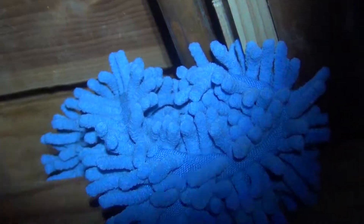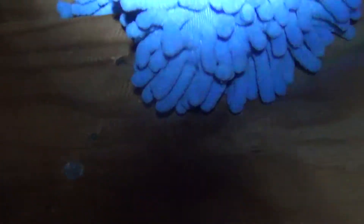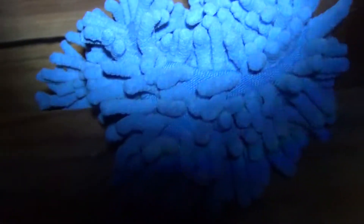I shoved my wash mitt in there hoping that would work — it did not work. I bought a water hammer arrester. There's a pressure-controlled pipe that makes the water go somewhere else under pressure; it relieves the pressure in the line and we're going to try that and see how much of the thud it gets rid of. You heard a thud — the next zone on the sprinkler system is even louder. We're going to try to get rid of that with a water hammer arrester, because those thuds are going to cause these pipes to blow themselves apart sooner or later.